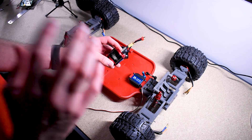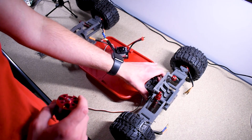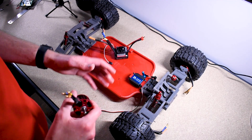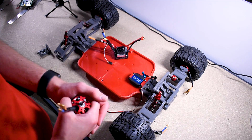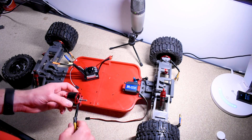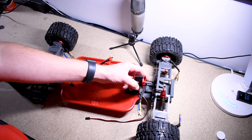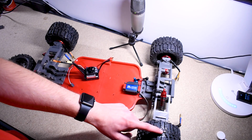With version 2 in mind, the main challenge is how to effectively position the motors up on the subframe floor plate so we can have gearing and a drive shaft to deliver power to the wheels. I'm going to need to make this area more of a housing rather than a frame-type design. I want to eliminate having them in the hubs to minimize parts, and having the motors mounted up on the floor plate should give us a better weight distribution across the car and more traction at the wheels.